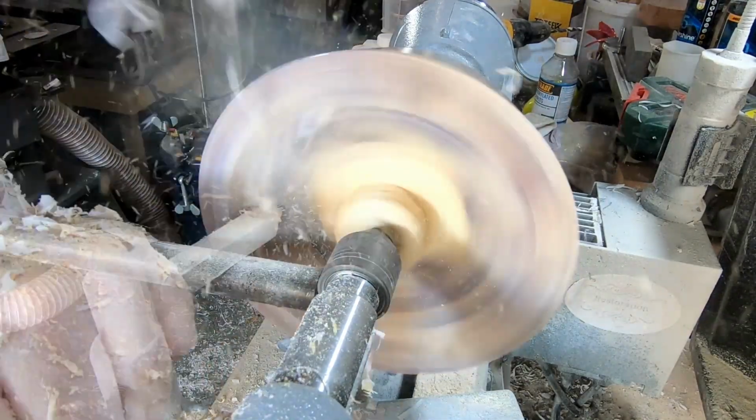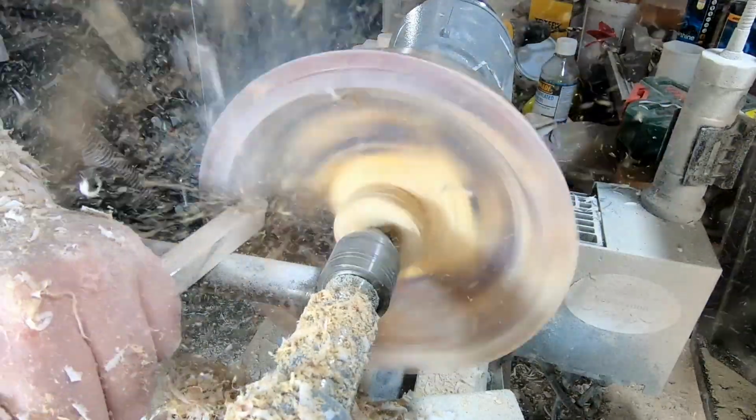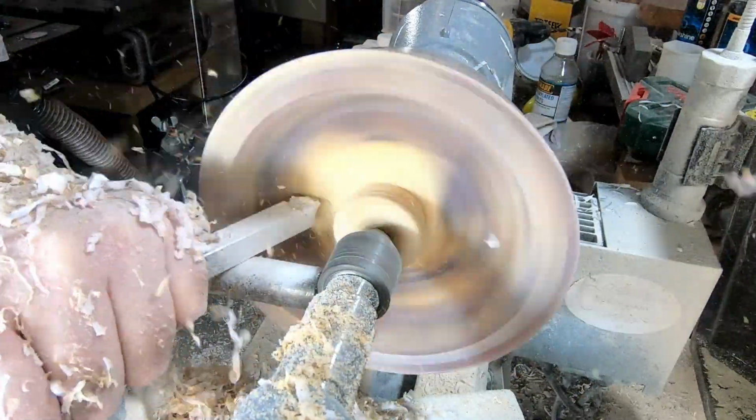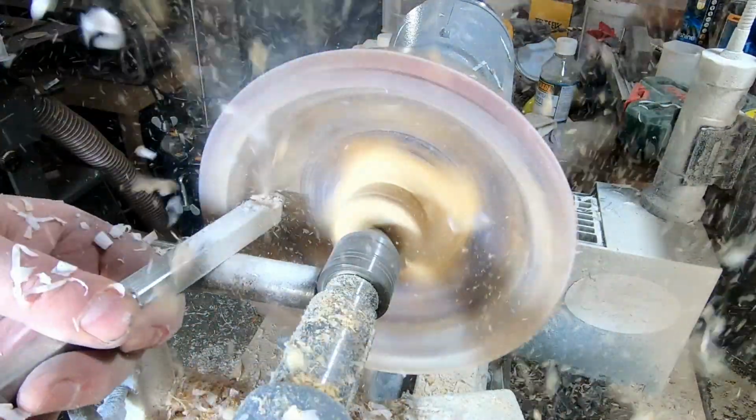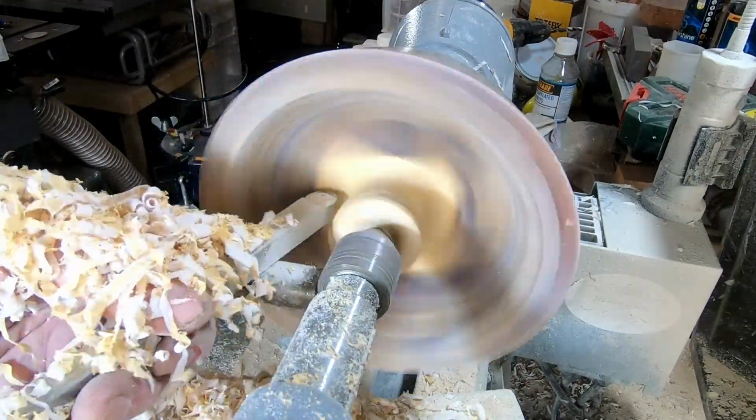The gouge works well for removing the excess material, especially when there is a lot of wood mixed in with the resin, but leaving the tailstock in place does restrict access, so eventually I have to resort to the EasyWood Tools full-size finisher to continue hollowing out.